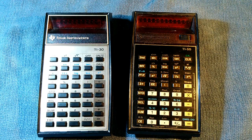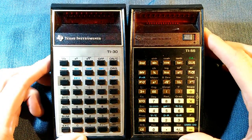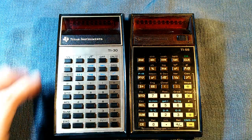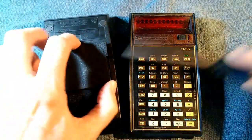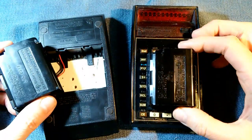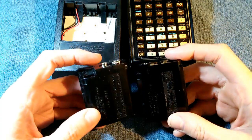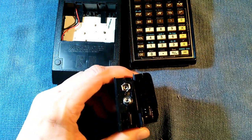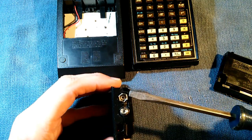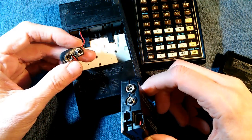At the same time the TI-55 was in production, Texas Instruments also made the TI-30. These two calculators are quite similar physically. The TI-30 was considered an economy calculator whereas the TI-55 was more of a premium calculator. The TI-30 also has a battery pack nearly identical to the TI-55's. The TI-55 pack is called the BP-7 and the TI-30's is called the BP-8. These battery packs are identical except for their connectors — the BP-7 has a proprietary three-pin connector whereas the BP-8 has a standard 9-volt type connector, and correspondingly the calculator also has a 9-volt type connector inside.